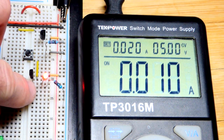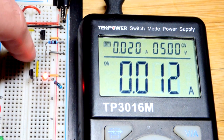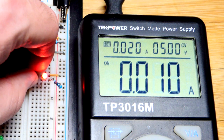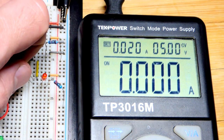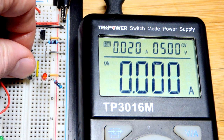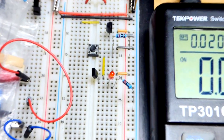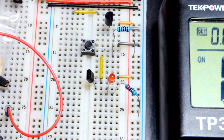So now the source is down here instead of the drain. The drain is up there. You can see it's not working right. The LED is staying on. And so that's one nice thing about this. You put it in backwards, it's actually pretty clear. You got it in backwards. So now we have it forwards, and so that's one way we're going to use it as a diode, probably in the next video. Let's zoom in a little more so we can see it a little better.